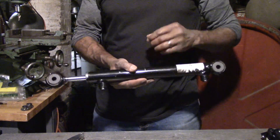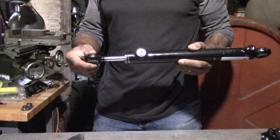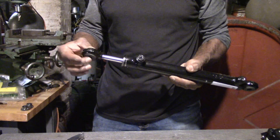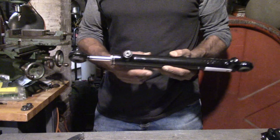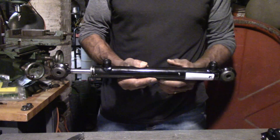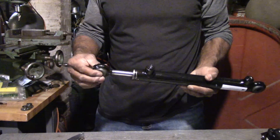This is the cylinder I'm going to use to lift and lower the chest armor. It's the smallest I could find which had the construction quality that I like. It has a one-inch bore, that's about 25 millimeters, and the rod is five-eighths of an inch, or about 16 millimeters.